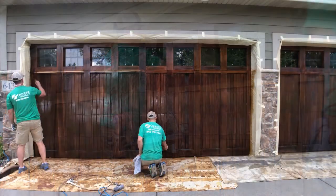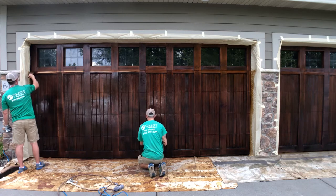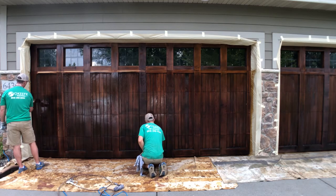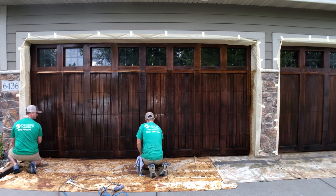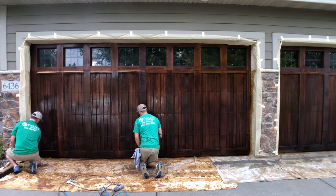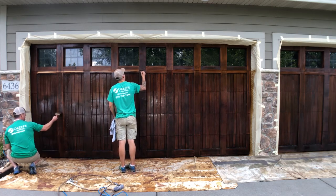Part of our video cut out during the spray application. What we did was hold a cardboard shield at the point where we stopped with the brush, using that as a guard, and then sprayed it on with a 517 tip. We're using a Titan 440; the pressure is set very low, down into the stain dial area — probably around 1,000 PSI. We used the cardboard shield to guard the glass from overspray, then back brushed everything. It takes about 30 minutes total for the application and babysitting. The second coat application is no different and we do have footage of that later.